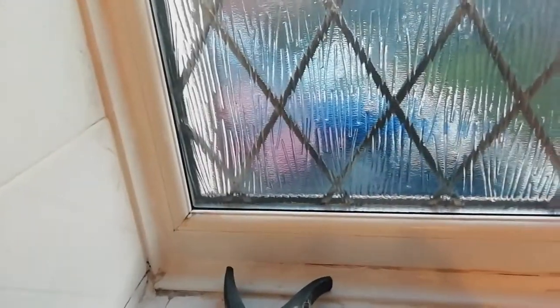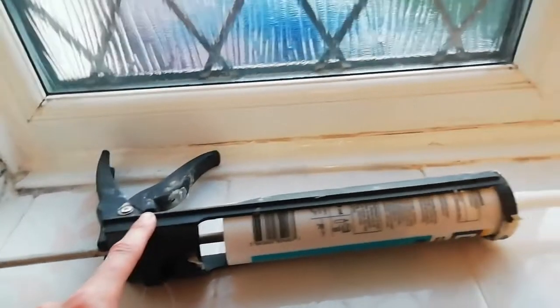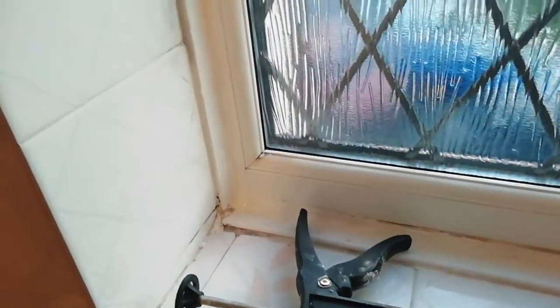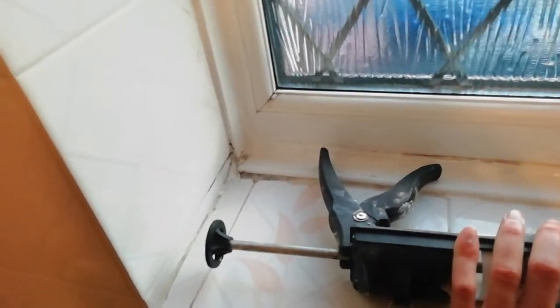And I'm going to do that on all the other windows. I'm going to fix the top corner as well. All I've used is just silicone and the gun here. I think the cost will be around about £10 to buy this. So it's just a really easy fix — if you can feel a draft coming through any gap near your window, just use silicone and seal it.